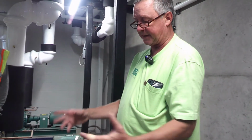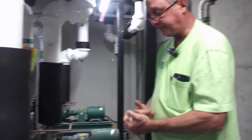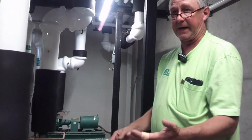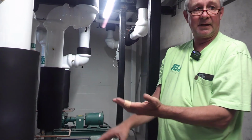With a gasket, because they come in a box all bound up, it irritates me. They don't listen to me, so it's not going to change. What I usually do first is find the gasket I need, and I'll find like a table and a box, put it on the gasket, and then I'll help flatten it out while you're doing all this other work. Okay, makes sense? That way it stays in place.